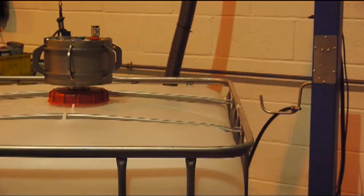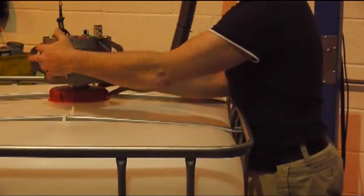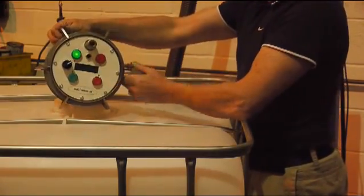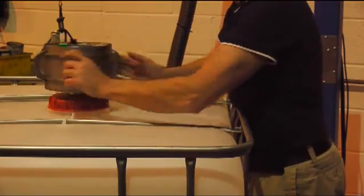If the test times are longer than the production rate, then multiple buttons are used. A button is placed on each IBC, and when the first button is finished testing, that button is placed on the next arriving IBC. The button can also be used in conjunction with conventional testers. For example, if the conventional tester rejects an IBC, the button can be used to carry out the retest instead of bringing the main production line to a standstill.